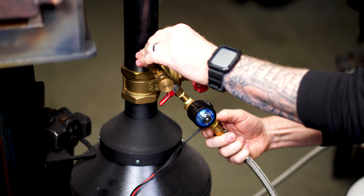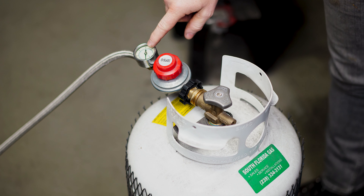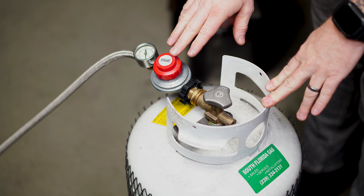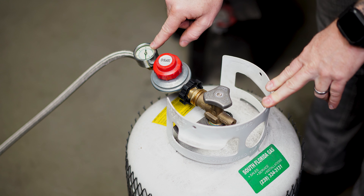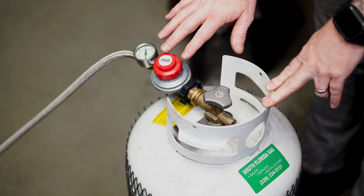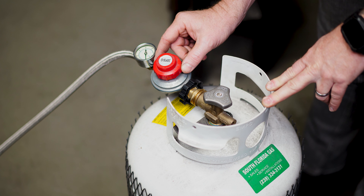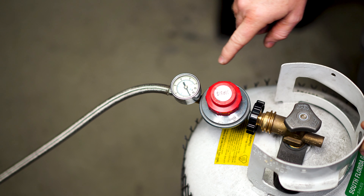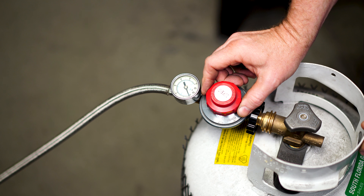Plug in the propane, go over to the propane bottle, and turn it on. At this point nothing registers on the gauge yet. I need to stress: when you build an Apollo or a ribbon burner, you must have a hose with a regulator on it — a dial on the regulator and a gauge so you can read flow from the tank. Without that setup you cannot properly tune and fire your Apollo. Dial the regulator up to about 1.5 to 2 PSI — on the gauge that's a very small tick mark.